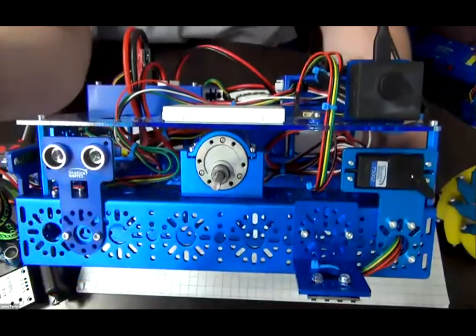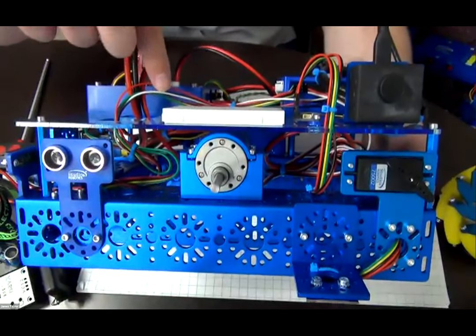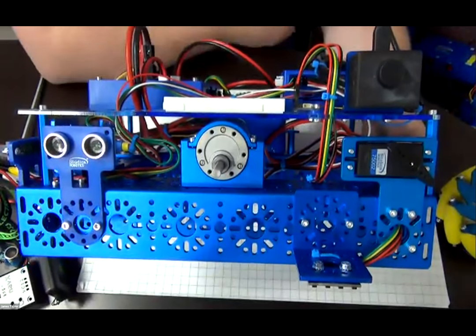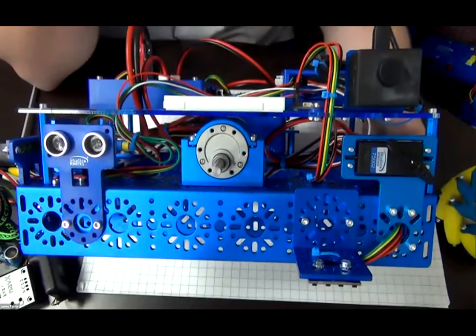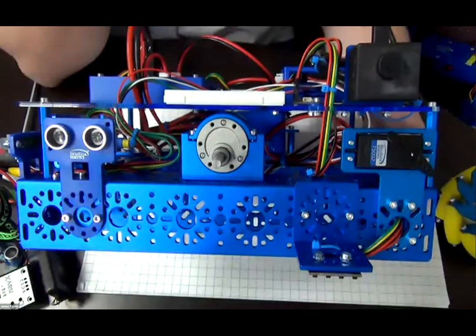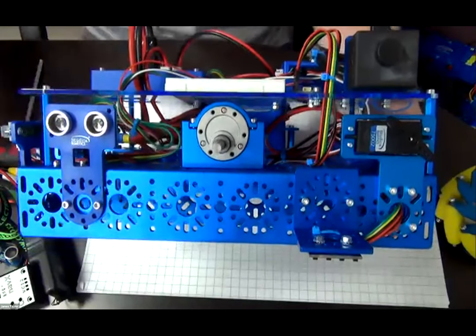And then we have the sharp IR sensor, which flows up through the same area here, as you can see the cables here, and then goes to the analog port on the VMX. Now, what we'll do for you later on when we're done is pull away the front of what you see here, and we'll take a quick picture of that and try to label each wire. We'll send that out with the documentation this afternoon, just so you can see what pin each end of the cable is actually plugged into, okay? And we'll make that nice and simple and easy for you.